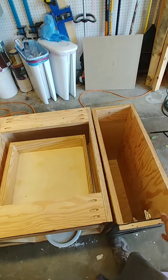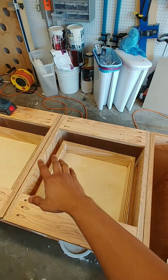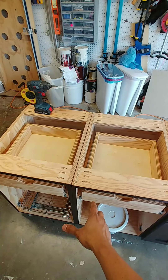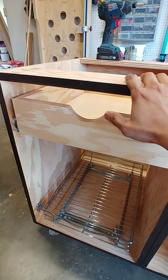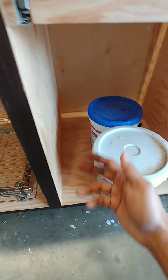Before I fasten, I have to make sure the cabinets are all together to my liking. I'm going to clamp them at various places — especially on the top and on the front — to make sure everything is level with each other. Once I clamp everything together, all I've got to do is screw them in with the FastCap at different places.